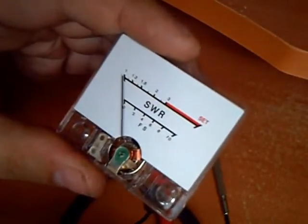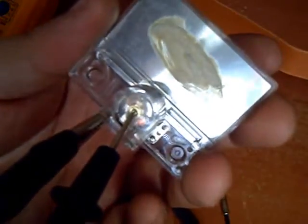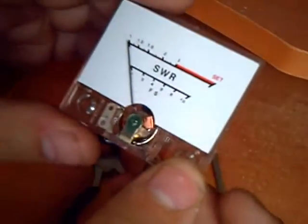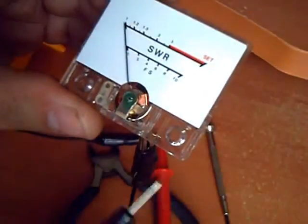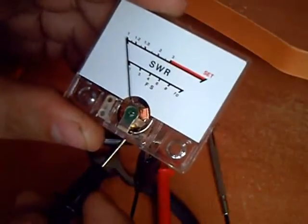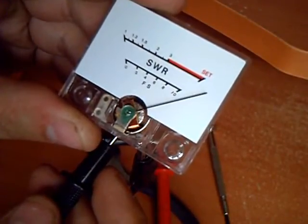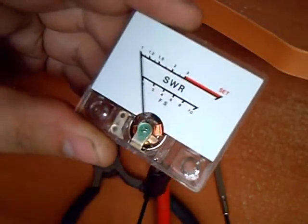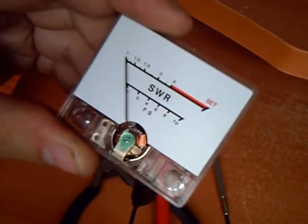I took a look at the meter. Instead of actually removing the movement, I've readjusted the setting on the back of the meter using this little screw and a slider. Between the two of these, they interact with the meter to make it move freely and to set it. Now the coil itself is actually fine, so the meter has survived — it just seems like it was misadjusted. The needle is actually moving back and forth now like it should be. Now I just need to put this thing back together and remount it back into the unit. Then we'll take the other meter and see if it's doing the same thing.